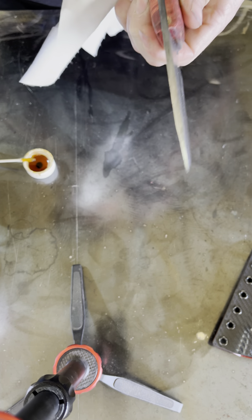If you want to etch your blade, there are multiple different ways to do it. Number one is this ferric chloride that I'm using now. Number two, I've used muriatic acid. I've also used muriatic acid and steel wool — it dissolves — and then you add some peroxide to it as well. I can't remember the exact blend that's required, but you can look on YouTube and find that blend. And then you could also use vinegar, you can use mustard. Basically anything with an acidic content will darken steel.